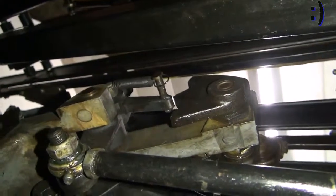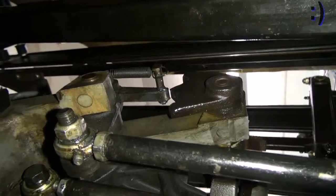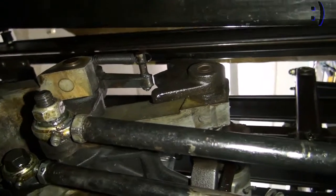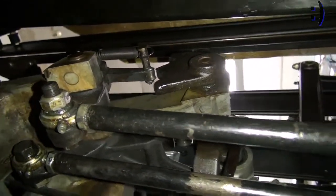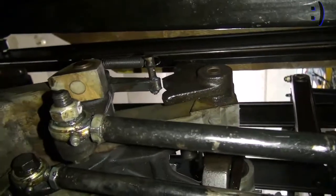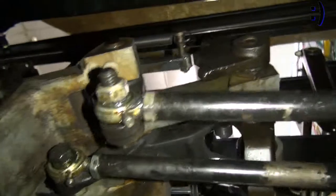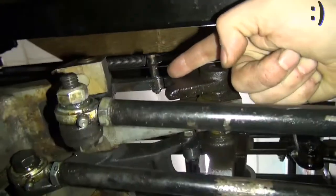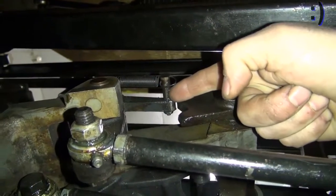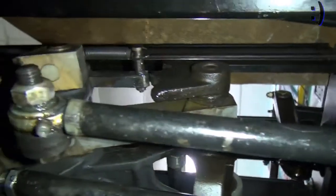If you had to change the table height, position, or level, you must go back and, before you run this, make sure that the respot rod adjustment is correct. To do that, put the table at home or 355, partially close the respot cells until the center point of the shifter cam is directly across from the finger link here. What you want is about that much clearance.